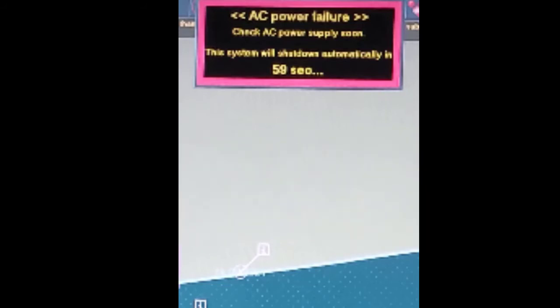Regarding emergency power, as per SOLAS regulation, emergency power equipment should come on load automatically within a maximum of 45 seconds after the failure of main power supply. When power failure takes place, the emergency generator is normally started. The generated power should be capable of supplying all services essential for safety in an emergency. See SOLAS Chapter 2, Regulation 43 3.13 or Regulation 44. Emergency generators are also required to have three consecutive starts. See SOLAS Chapter 2, Regulation 44.